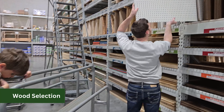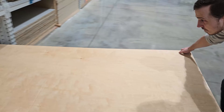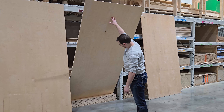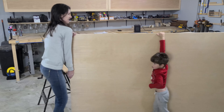The first step to any project is wood selection. Getting this right means setting yourself up for success, but messing this up can mean endless headaches down the road. Plywood is generally easier to work with than hardwood since you don't have to worry about wood movement. It's also flat, dimensionally stable, and isn't likely to bow or twist. This makes it perfect for a beginner project.